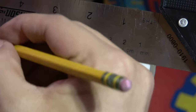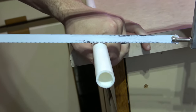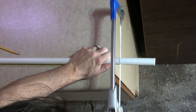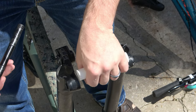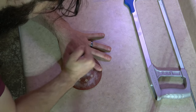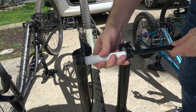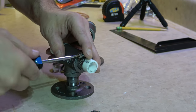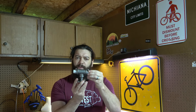I need to cut the pipe to 110 millimeters since my hub has boost spacing. Cutting tubing is always hard. I'll need one piece of PVC for each of the two mounts. These pieces will keep the fork legs from bending. Just a little bit of sanding should make it fit properly. You just put these together and give them a good old twist.